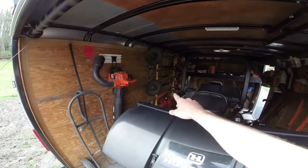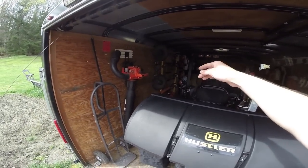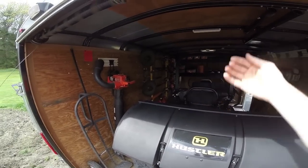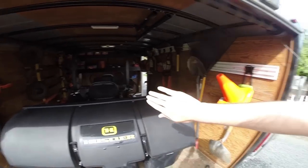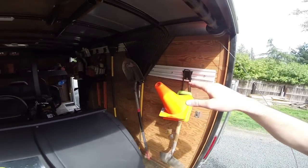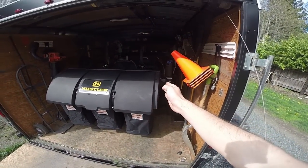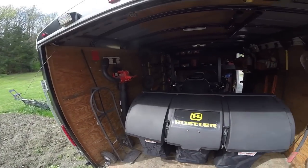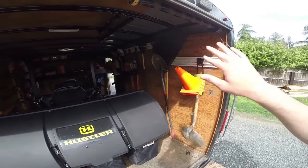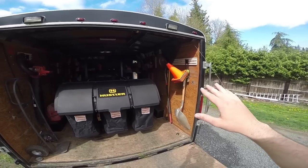Let's go ahead and talk about the trimmer racks. The reason I recommend putting them on the right-hand side is because the knob to unlock the yellow racks is on the right side — so you need access from that side. If we place them there, we can access the trimmer much faster. We didn't do it initially because I thought the bagging systems and blowers would interfere, but we'll probably move them over to the right-hand side later this year. That is probably one of the biggest tips I'd recommend when installing trimmer racks.